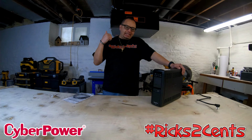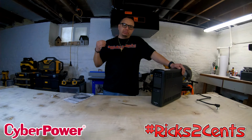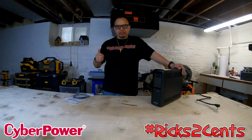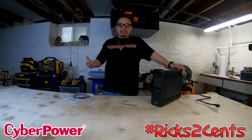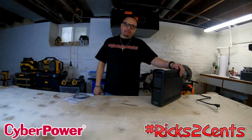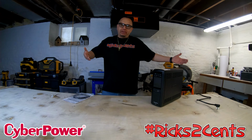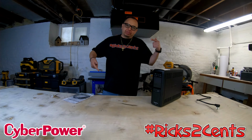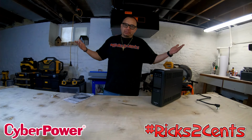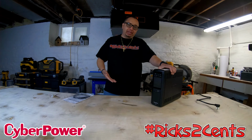Protect your equipment and condition the power that you are supplying to your piece of equipment, so that you'll have consistent results. Your number one source that's going to make or break a situation or fluctuate the results of your laser is the power. That's it. Power. And probably air. But power. If your power is all over the place, you're not getting consistent power, you're never going to get consistent results. So do yourself a favor, buy one of these. I'll drop a link in the description below. Pick one up. They're fairly cheap. They're inexpensive. Like I said, of everything you're going to buy in your shop, this is probably the cheapest investment you'll make, but the wisest one.